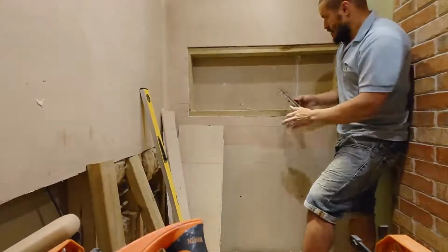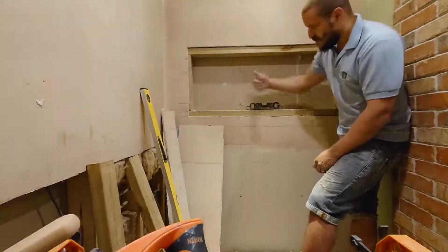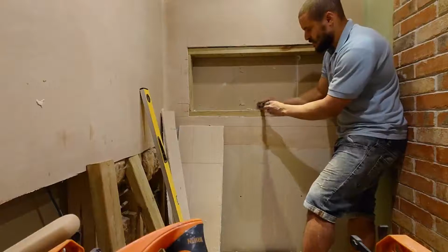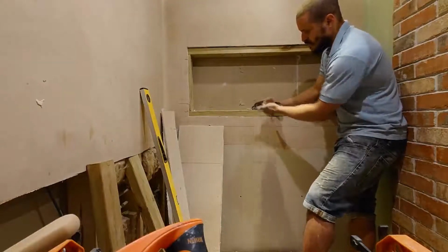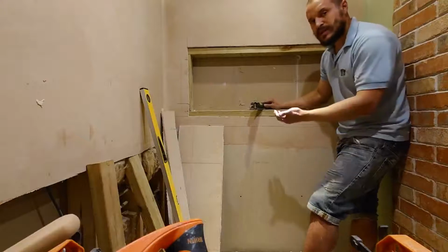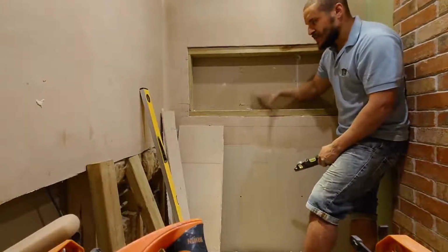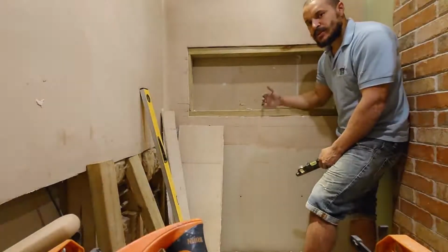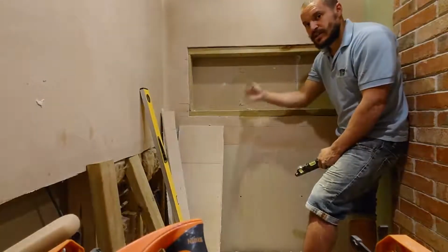One other thing I did do is, from a measurement point of view, obviously we level across here, and then this space here, could do with a small one really, but put an angle, it's just a slight angle away from the wall, likewise here as well. And then what that will allow for is, when I'm laying my next layers on top, I don't need to then consider the slope that I need to introduce on any of the other layers.